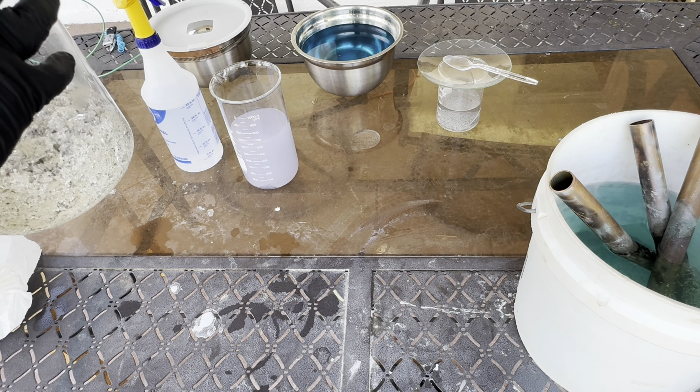As far as my setup — I used to have alligator clips on the bowl. This year I went with a big worm drive clamp, a couple plates of copper, and I have the copper connection right here in this plate that runs along the side of the bowl. That's my biggest difference. The alligator clips, when clipped onto the bowl, would rust out from the fumes and the exposure to the nitric. In my opinion, they didn't have as good of a connection as this. Kevin, thank you for all you do — if you guys don't know who Kevin is, go check out his channel.